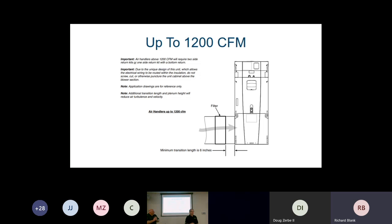On any heat pump coil, if the TXV or the EEV is in the closed position, we should still have the ability to flow nitrogen in the suction line or the large line and out the liquid line, because the internal check valve on the TXV or EEV should allow it to flow. Very good. So that is a good point, because all of our TXVs, and particularly the EEVs that we're now using, are internally checked. So therefore, we do allow a bypass of that refrigerant to come through there. So that does bring up a really good point. Depending on which line they're putting the nitrogen in first, we should be able to get that through.